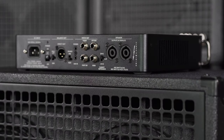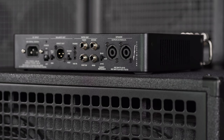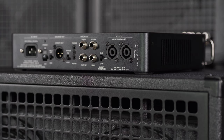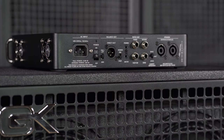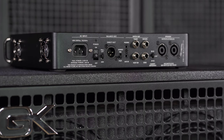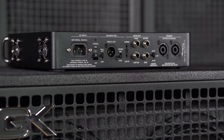Now, most connectors in amplifiers, unless it's a military product, are tin. And tin, over time, does slight little corrosion. And as the tin connectors vibrate, they build up little corrosion dams. And eventually, a few years later, you get these interconnection problems. We run into it in our old amplifiers, and it's the main issue that happens after 5 or 10 years. So we've eliminated that problem entirely with these new products.